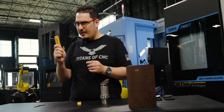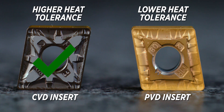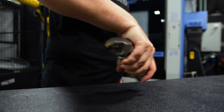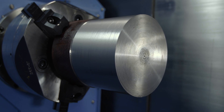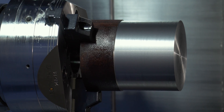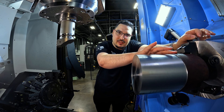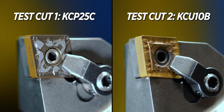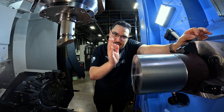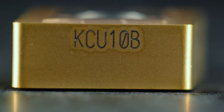So the PVD inserts generate less heat, but the CVD inserts can withstand more heat. The CVD inserts are more focused on one or two types of materials — this particular insert shines best on steel. I've got a piece of 4140 here. I've faced it and turned across it just to get rid of the scale. Both inserts are on equal footing. I'll start with the KCP 25C, do one test cut five inches, then put in the KCU 10B and see what they do.